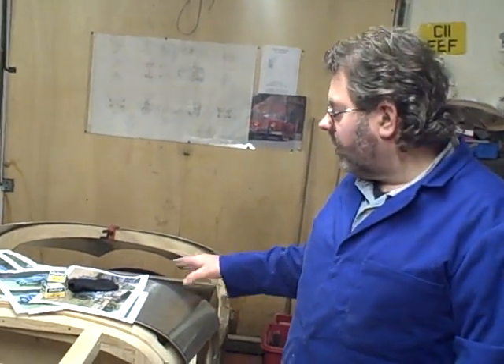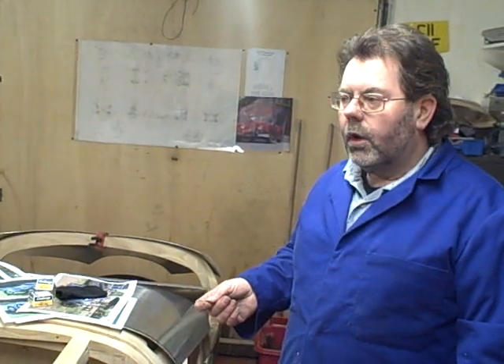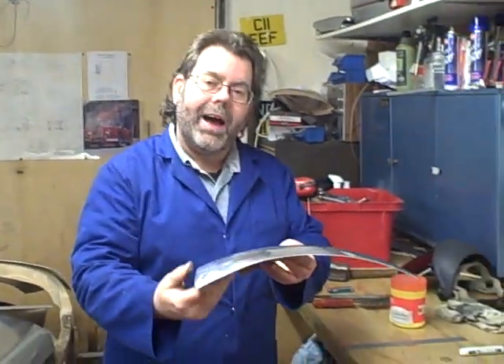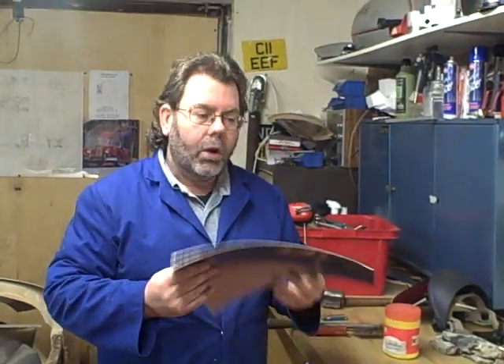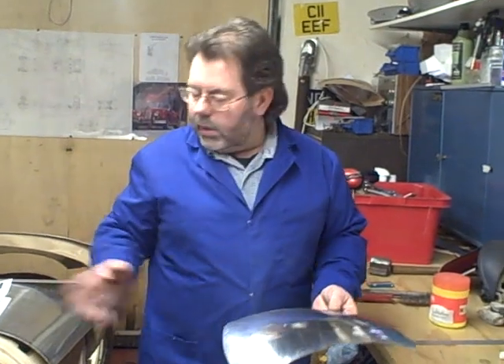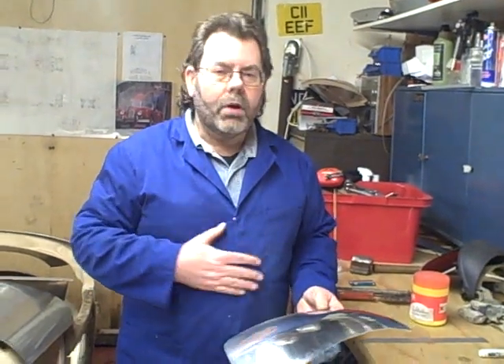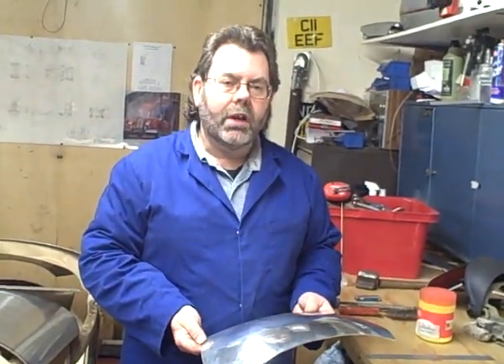The reason being, once you've welded the component, you need to continue to re-work it, re-wheel it. Panel makers weld panels together, hammer them, planish them smooth and then re-wheel it to get the welds to disappear. TIG welding happens at a cooler temperature and the metal is still somewhat brittle. Also, it doesn't penetrate quite as well, because the shielding gas is only aimed at the top surface of the metal and can't shield the back. Subsequently, the welds are often weak on the back. When you planish them up and re-wheel them, they frequently crack. You can't have panel work on an expensive car cracking the paint and falling to pieces. So I personally still favour the old-fashioned method of oxyacetylene welding aluminium.